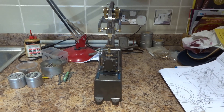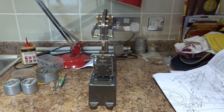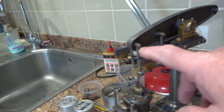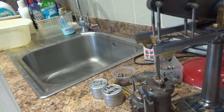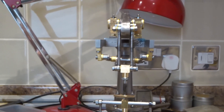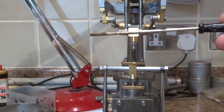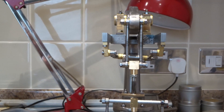1st of April 2021, the appropriately named April Fool's Day. I'm still working on this Stuart beam engine and yesterday did a trial assembly of - I don't know what you call it but - the link motion. And yeah it works, seems to, but it ain't right. What is wrong to my eye is that this pivot across the back is at a slight angle to this cross head, and I can't leave it like that.